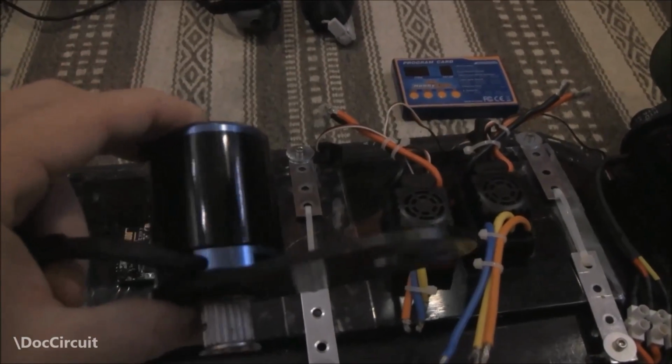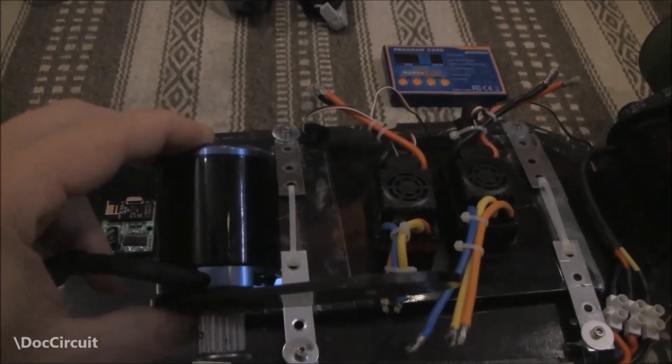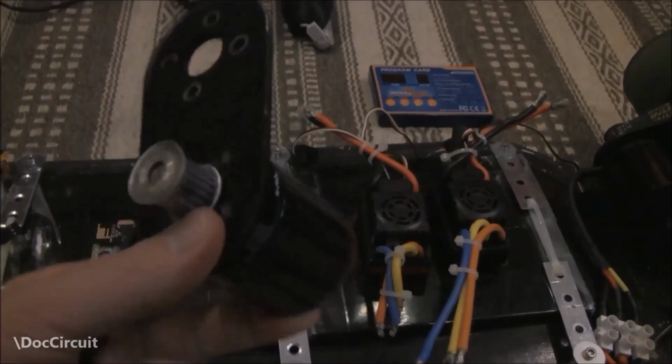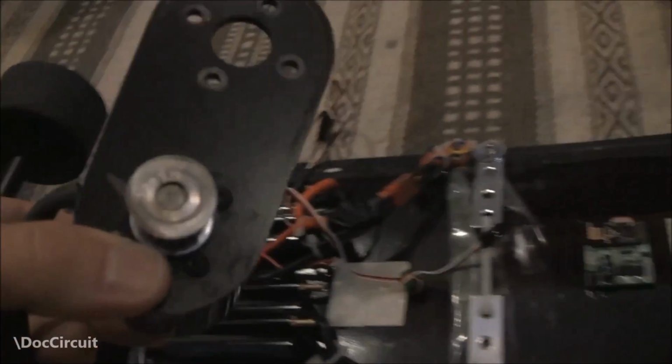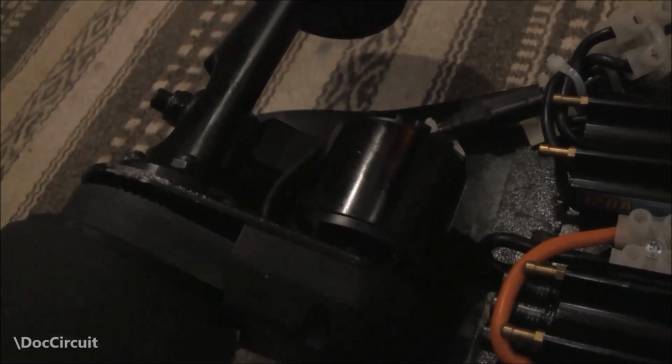Well, pulling to one side, I diagnosed it being this motor. It's a Chinese clone electric longboard motor, but it's from the first generation and is not quite the same as the current generation. So I replaced that with the current generation motor. So you've got one at the front there and one at the back, and they're identical.